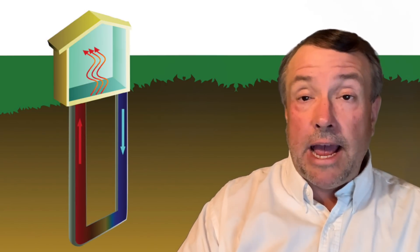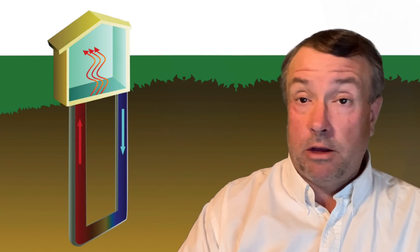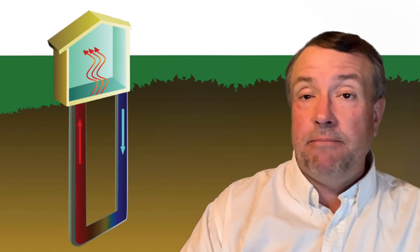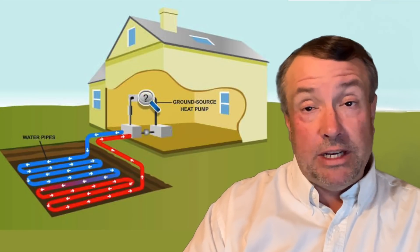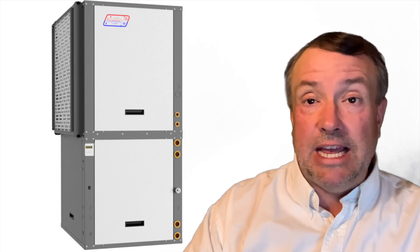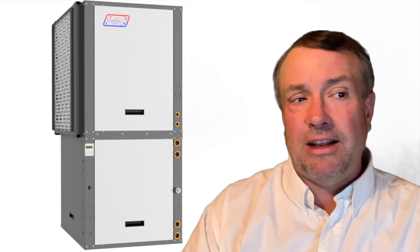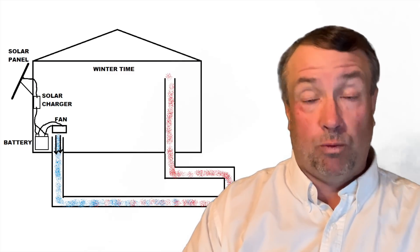Let's do something interesting today. I'm going to talk about low-grade geothermal greenhouse heating and cooling. When I talk about low grade, what I mean is there's no heat pump. The residential geothermal heating and cooling systems you see advertised employ a heat pump that can multiply the heat using pressure, and it costs a lot more electricity to use than a low-grade system. The problem with a low-grade system is it's not as easy to regulate temperature within the range you want for a residence.